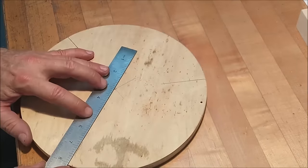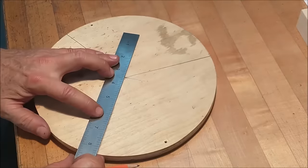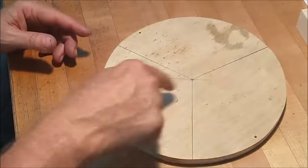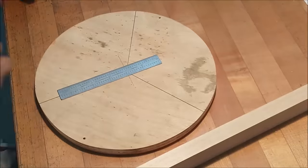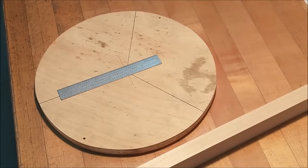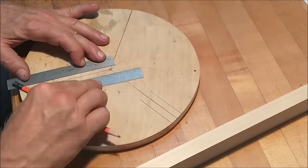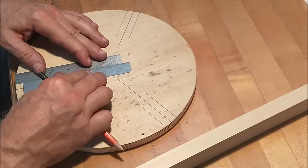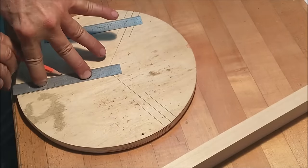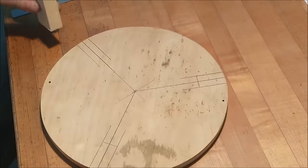Somehow that thing got shorter by this cut. Close enough is good enough — plenty good. The three-quarter inch wide board worked out perfectly. I'm going to grab another scale and go alongside it so I know it's parallel and centered to the line. That technique works really well. Now we're going to jump over to the bandsaw and notch this out so these boards fit right in there like I'm sketching.